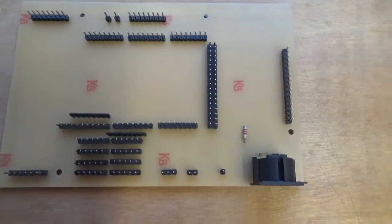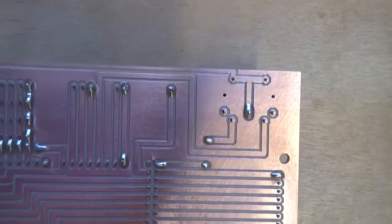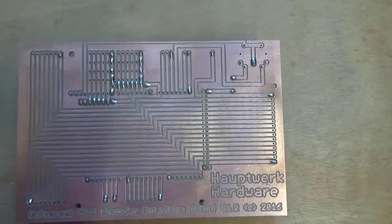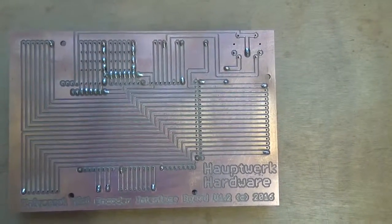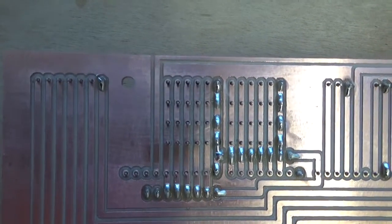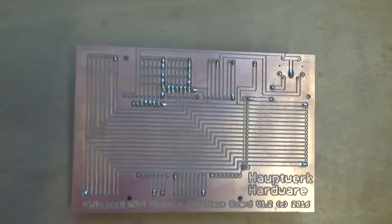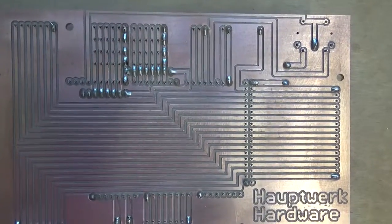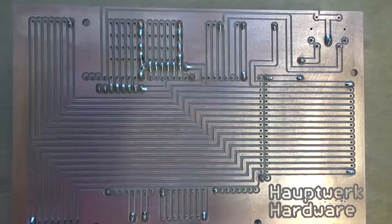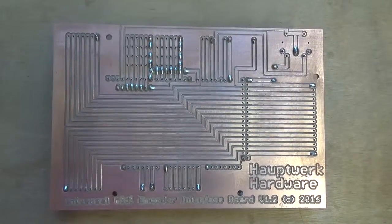The board is now fully populated — everything's on and ready to go, though still only tacked on. The MIDI socket I've just put on with only one connection soldered so far. All I need to do now is go around the board and solder all of the other pins to the copper. It's worth noting that the copper tracks are actually very small and very thin, so you have to be careful not to get them too hot with the soldering iron and not to put too much pressure on them, or they'll lift away from the board. If you don't get it hot enough the solder won't run, but if you get it too hot it can lift the copper away.